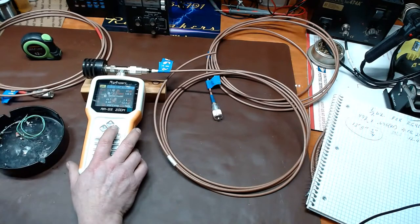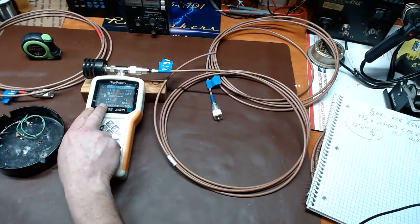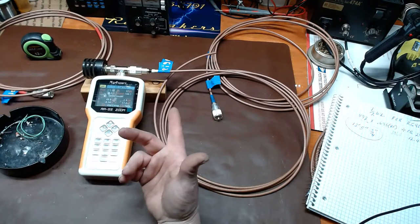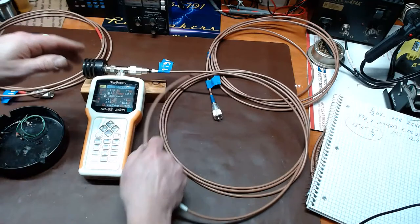Okay, X factor right now, we're at 0.47. 0.1. Okay, so roughly about 32. So this one's going to need to probably be snipped just a little bit. All right, so we've got an X factor of negative 0.3. So a negative number is going to do the same thing as a positive number in respect to this. What we're trying to do is get back to zero.